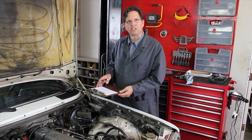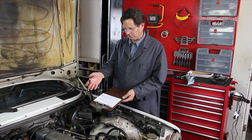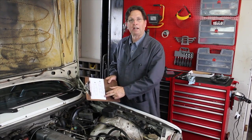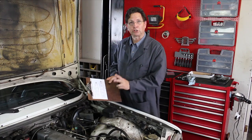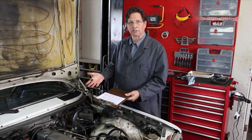The valve adjustment is done, and the results are pretty typical of most of these older diesels I work on. In fact, here, 8 out of the 10 valves we adjusted were too tight, and 2 of them were so extremely tight they could have severely impacted the results of a compression test.